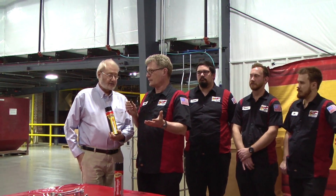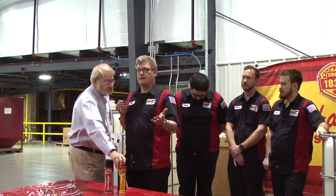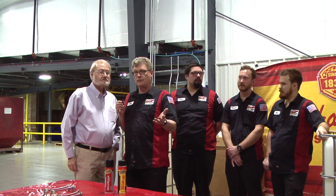If the lubricant is just sitting on the outside of the wire rope and doesn't penetrate the rope itself, it traps the moisture inside, increases the rust, and you can't tell if it's rusting, which is known as rouge. Typically, a wire rope is condemned when the rouge spot is one half the diameter of the wire rope.